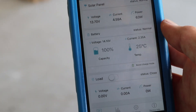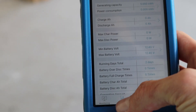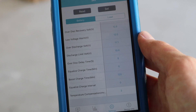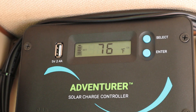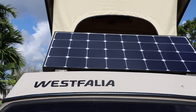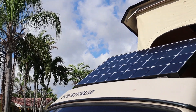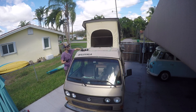The Bluetooth app is pretty simple to use and it'll tell you pretty much everything you need to know. I do wish that the load reading would work, as it would be nice to see what power I was using. I'm also pretty sure that the settings for preferences can only be changed with the lithium battery setting. I have an AGM battery, so I set the charger to gel since that's pretty close to an AGM setting. I'm really happy with the way that everything turned out — it's going to be a game changer to be able to collect clean energy for the power in the van. See you next time and thank you for watching.